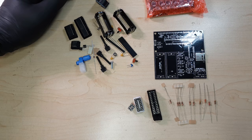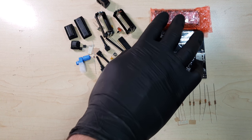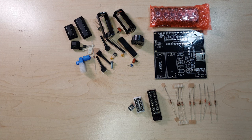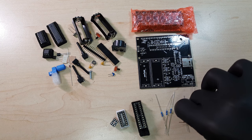While that's curing, we can tend to the electronics. These parts will become a remote control that can trigger the actual Tesla transformer. 5% carbon film resistors are unexpected and unacceptable in such a pricey kit, but they are standard values, so I can rectify that.